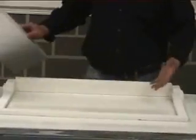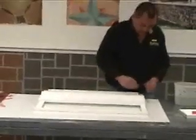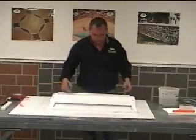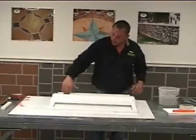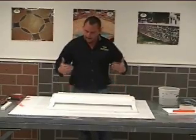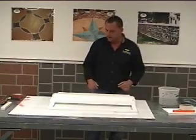So initially, at this point, I'd fill my surface, I'd fill my casting deck area. When it's full and level all the way throughout, I'm going to apply this into place, use something to affix it from floating. And I'm going to continue my pour on this front edge. Taking care now that I'm rubbing that front profile edge, that surface, whether I have a form liner in there or an edge detail of some sort, air trapped on that surface, you want to rub that loose, break it loose, and so you have a desirable profiled edge.